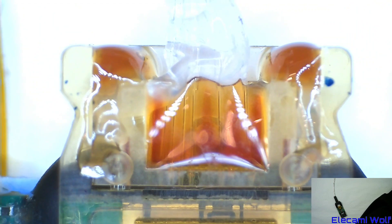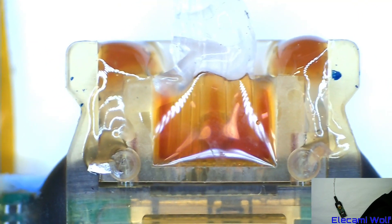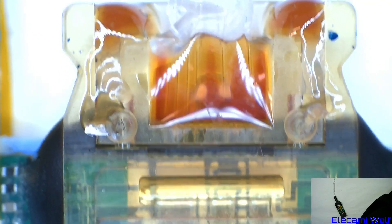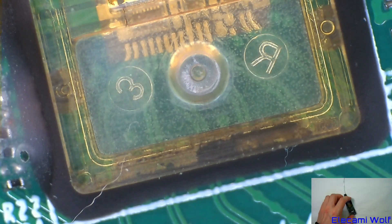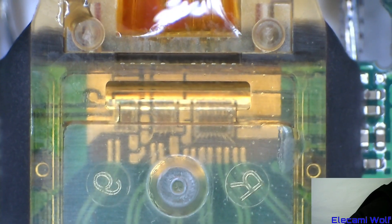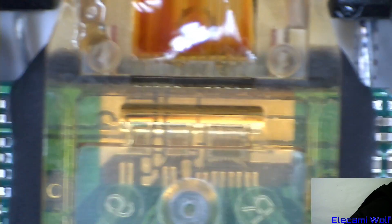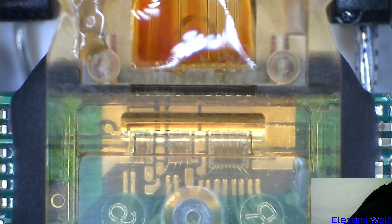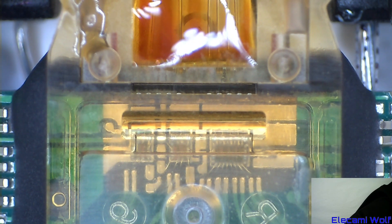I've used some colored glue here which makes it a lot harder to see than the other ones we investigated. Also the top of that seems to be diffused. This one's a little bit clearer. We can see the dies in there and the bond wires of the driver circuit integrated circuits on the left, and then the next one over — there are two smaller independent ones for the transmit and receive of data. On the right-hand side there's the one for transmitting the four data pairs for the video signal. We're looking at the One Connect box end at the moment.